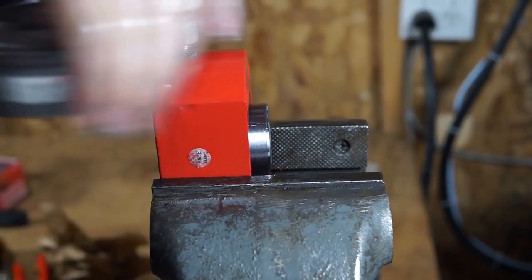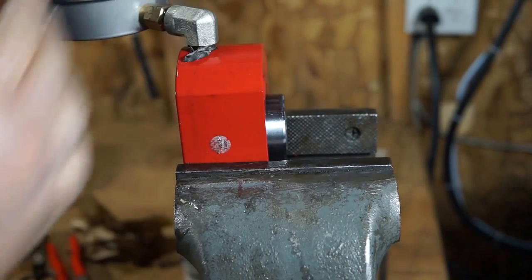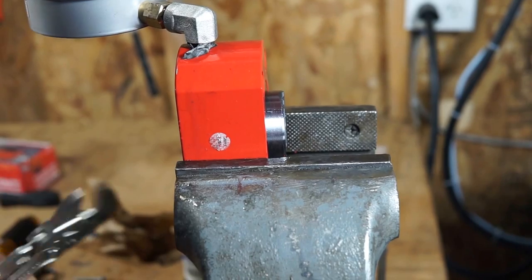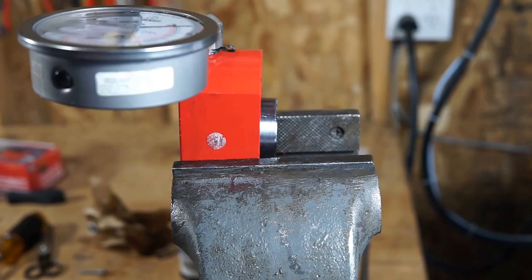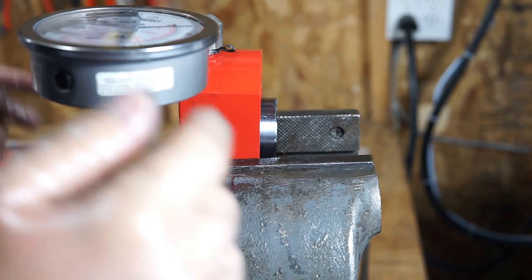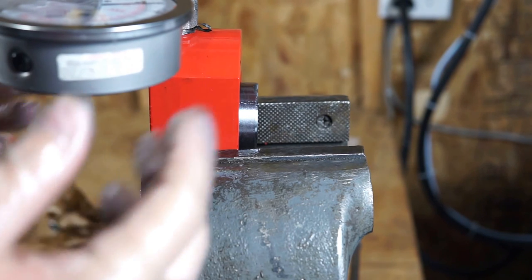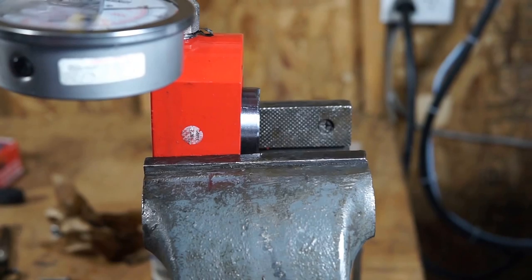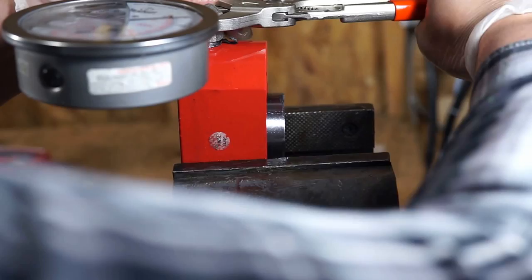All right, so I don't know what all I'm gonna cut into this video. I'm sure you don't wanna see me screwing on this gauge about 5,000 times. But what happened was, when I got all of the air out of the system, the gauge was starting to read positive pressure just by screwing it into the system. So I emptied out this elbow, and the system is just gonna have that much air in it to kind of provide me a cushion of sorts, so I get a zero reading when it's not under any pressure. Jesus, does any of that even make sense? My God, I just want this done. Ugh.